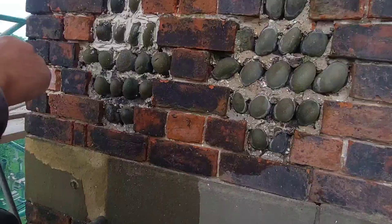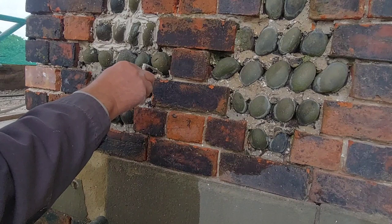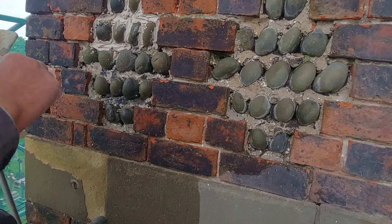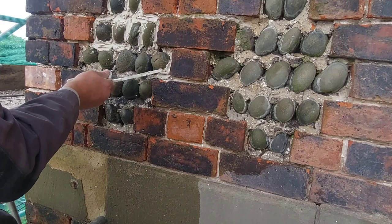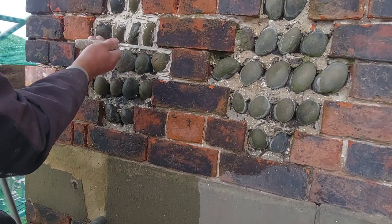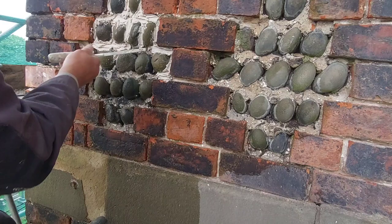But you can see in this original bedding, there's little bits of kibble, which is the unburnt limestone. So it's never slaked. It's just basically limestone that's not got hot enough and is unable to slake. It wasn't as refined then with the burning of the lime as it is today. I think there's a bit of potluck sometimes with it, whether it had worked or not, in all honesty.